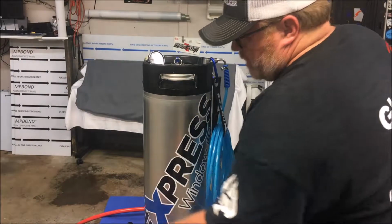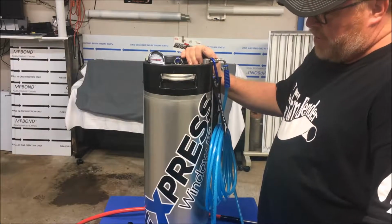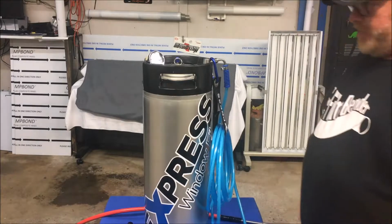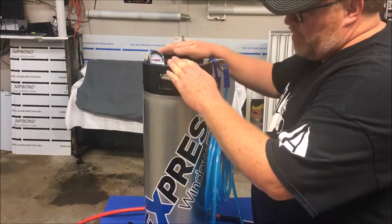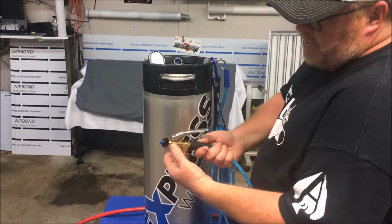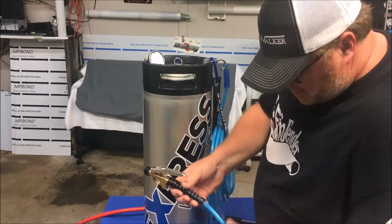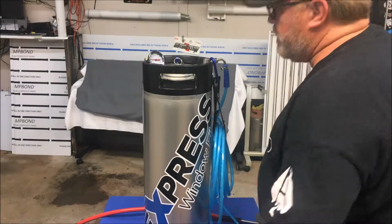We've got another one of our precision pressure tanks here. This is a platinum series for all intents and purposes, but we were commissioned by Mark Beauregard to do this in Express Window Films style. So anyway, what we have here is a precision pressure tank, brand new core, brass nozzle, complete swivel, 100 mesh filter or screen inside. Even the tip on it is an 80-degree flat fan spray tip, and all the colors are coordinated with the blue, white, and black that their logo was done in.